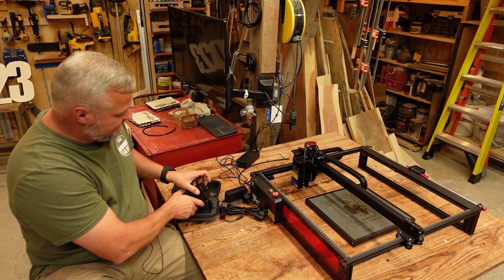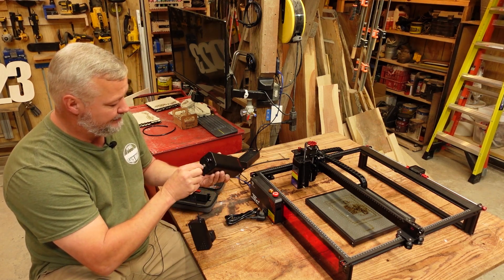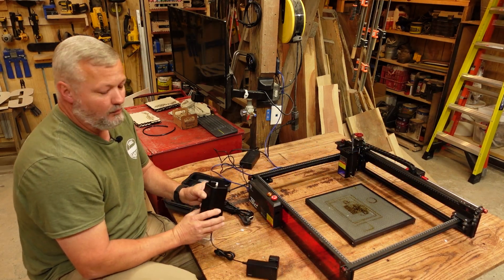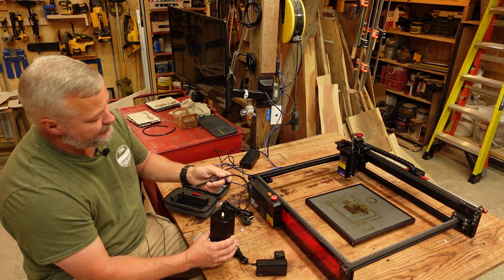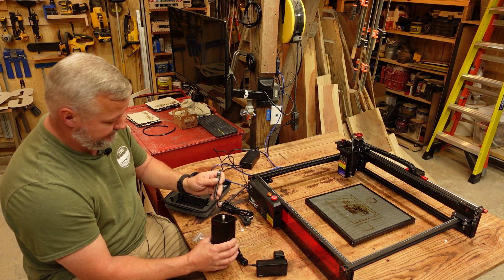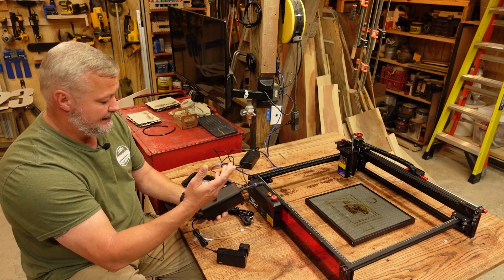The air assist pump — like I said, I haven't got to use it a lot because of the power cable issue, but the power on these things is pretty generic. If you've got another machine laying around you can borrow a power supply for the air assist. One other thing I had to improvise on was the pump outlet was a little larger than the hose that goes to the air assist. I went and got an adapter I had in my box already. It comes with one adapter but it wasn't substantial enough for this application, so I adapted the larger hose from the pump to the smaller hose connected to the machine and got that functioning.